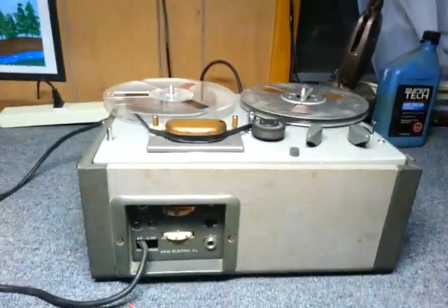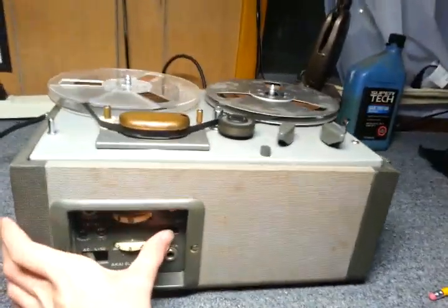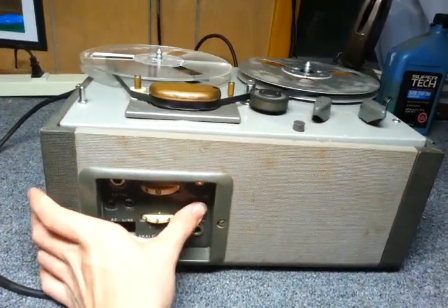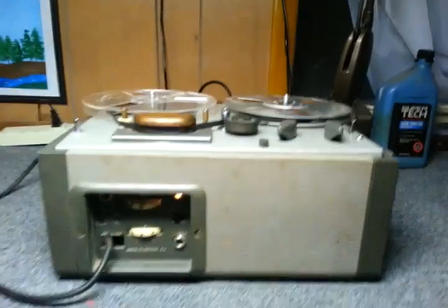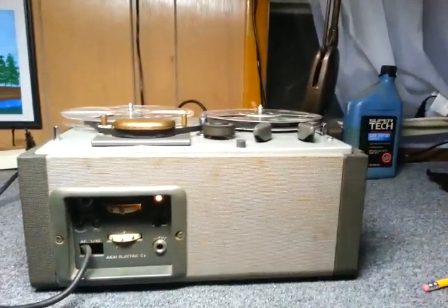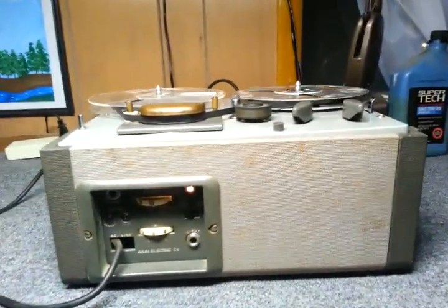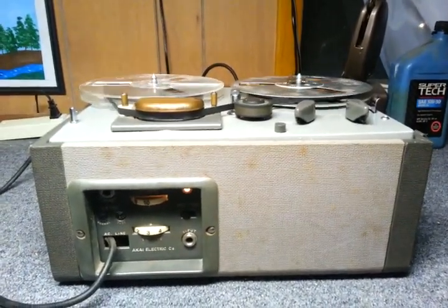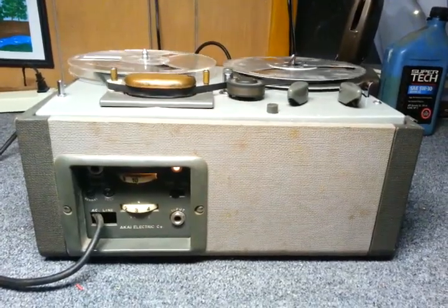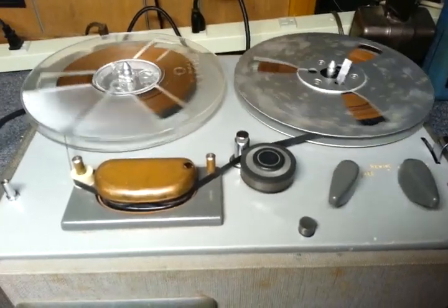So, no other country that I know of uses just 100 volts. It's either 120 or around there, like 110 maybe, or 125, or 240, or around there, like 230 or so, or 220. But this machine is set to run at 100 volts. It does not have anything to switch the frequency, although the motor specifies 50 to 60 hertz. And also I replaced the motor run capacitor, just to mention. And there is no voltage selector whatsoever.